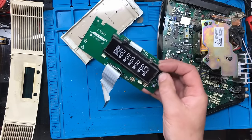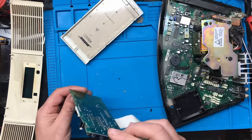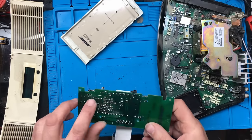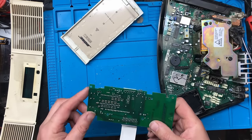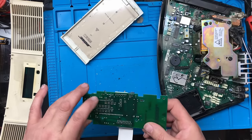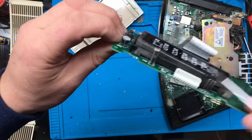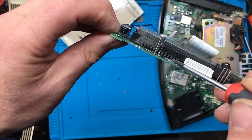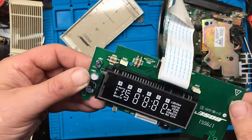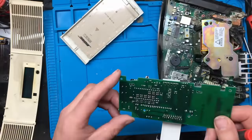Right, I figured it out - it slides forward, it's just stuck on the connector. You push that back and this part just comes off like that, which should give access to get the display out. Let's put the speaker wires to one side. I don't know if this is just the display - I'd suspect there might be a big IC behind this, and I can see something here. I think that's the actual clock chip just at the back under the display, and those are the pins for the vacuum fluorescent display.